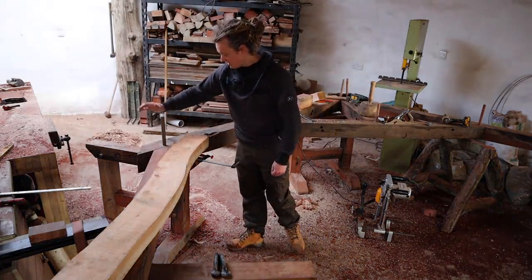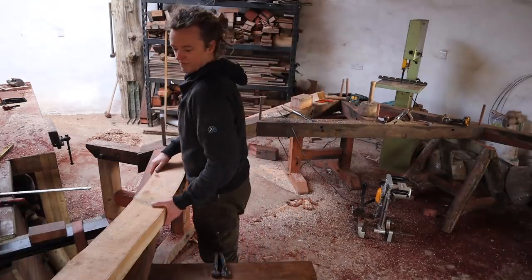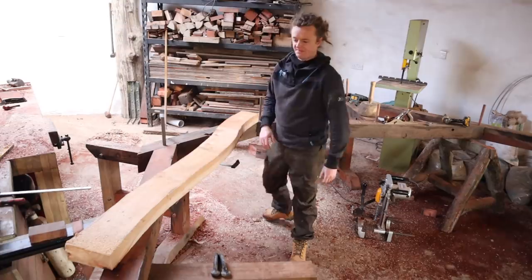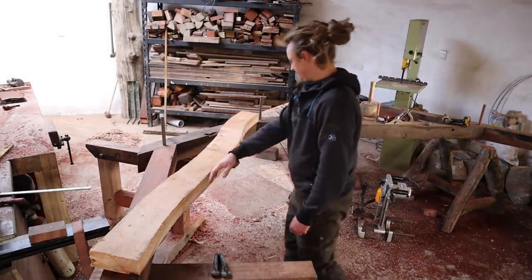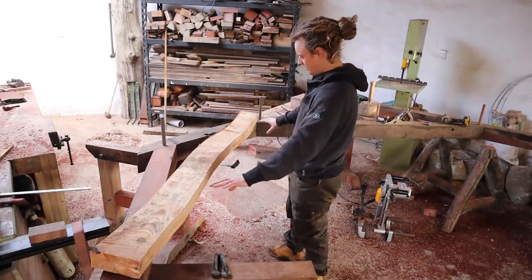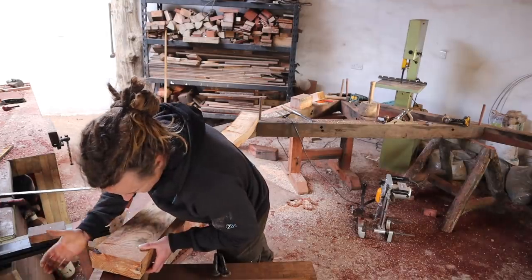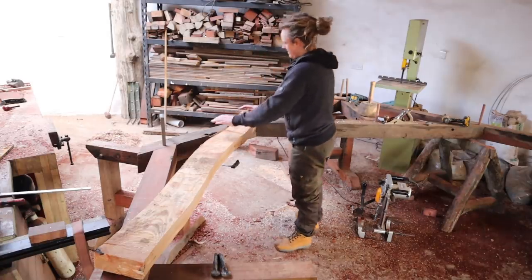There is a better way because we actually have a reference point — it's the actual frame itself. I've just temporarily pegged my posts and mortise-and-tenon joints with just a few taps to get them to squeeze up, so everything is sitting where it's going to sit. I can use that as a reference for the shoulders. If I slide that up to where it's going to butt in there with a tiny bit of overhang so it's not a sharp point, and bring this one down the same way — the other ones on the frame curve inwards, which gives you more space.